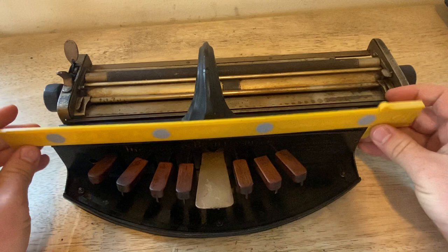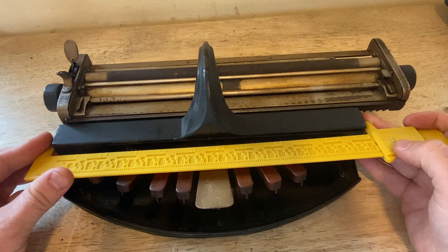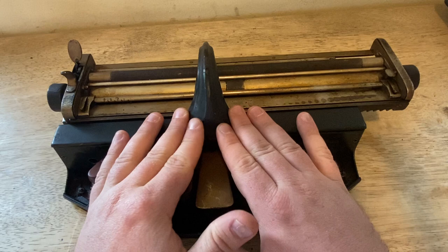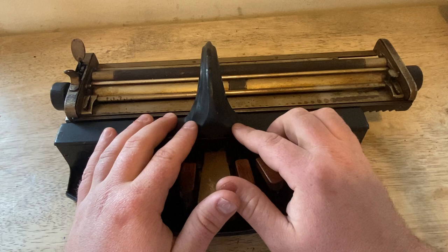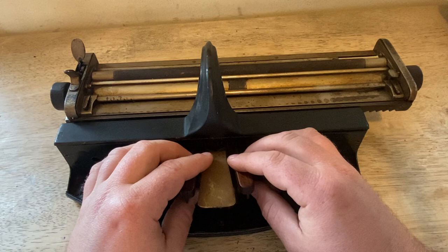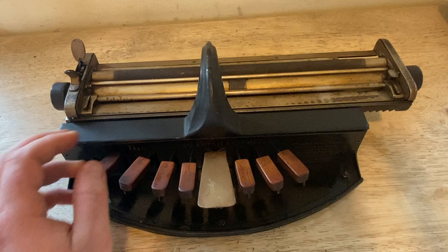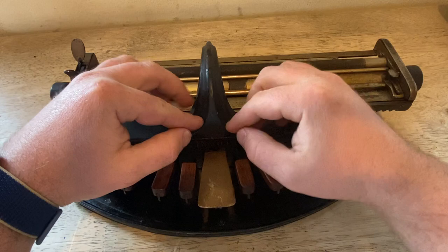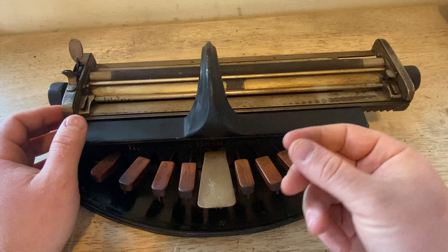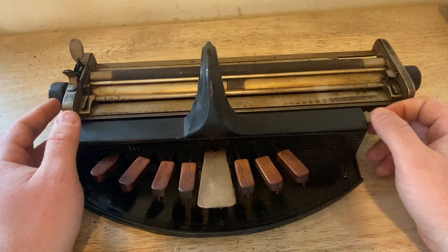The body of the Brailler is only about 11 inches wide, while the carriage is probably about 14 inches wide. If I bring my hands to the middle of the top edge, there's an arch that goes over called an arched die box. The way I think about describing it: if you've ever thought about an elephant drinking water and throwing its trunk up to splash water on its back, the arched die box looks like an elephant's trunk. It goes over the carriage and above the embossing head where the dots come up. The die box has little impressions, and the paper is sandwiched in between that — that's what makes the dots.